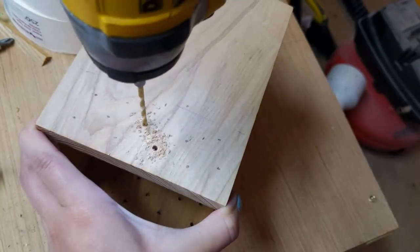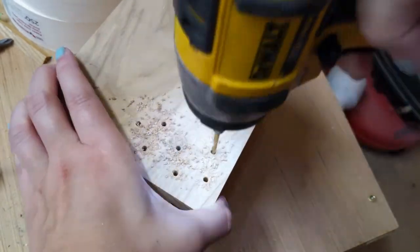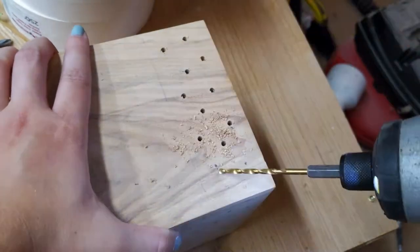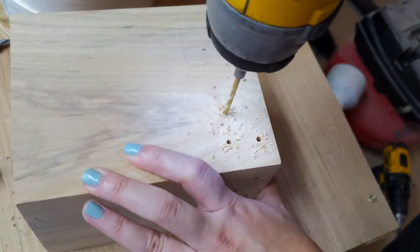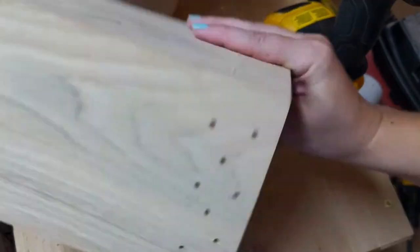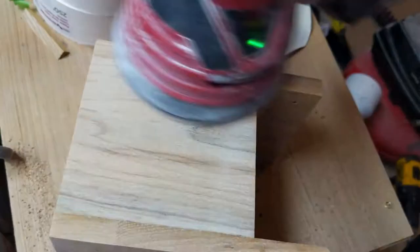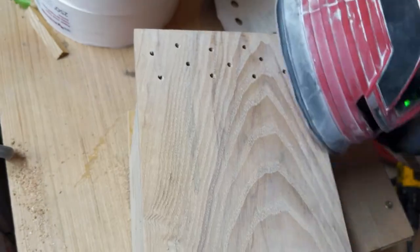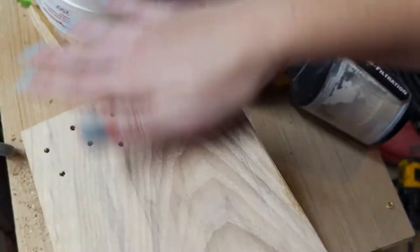To ensure that the baking soda in the bottom drawer and the essential oils can get some airflow, I drilled some decorative yet functional holes into the bottom area and all three sides of the piece. These were placed randomly, but creating a pattern is also fine. I did a final sanding step and noticed a small imperfection in one of the corners — I hid this by mixing some wood glue with sawdust I had just created and sanding it smooth.